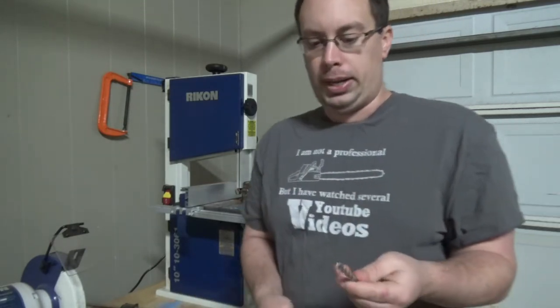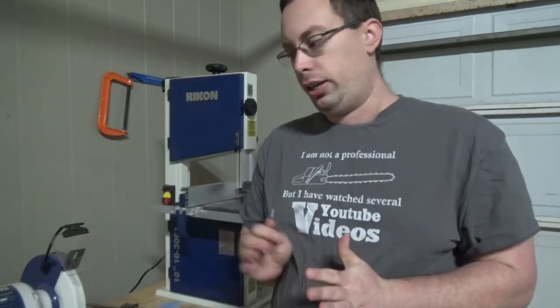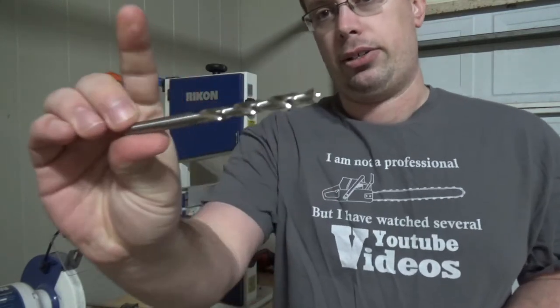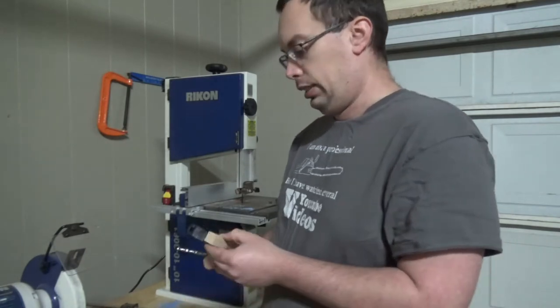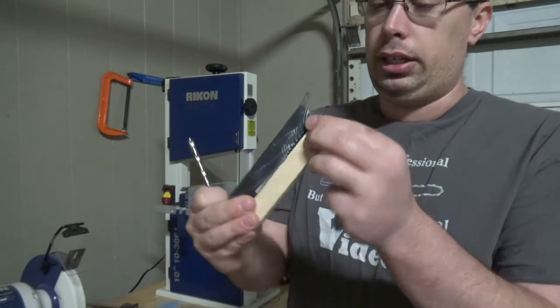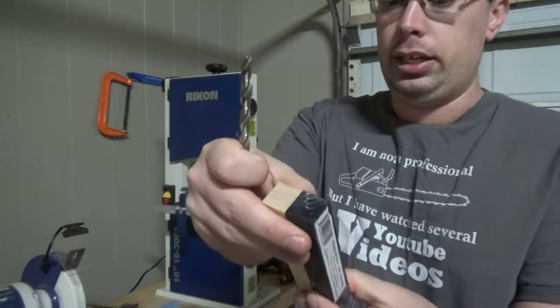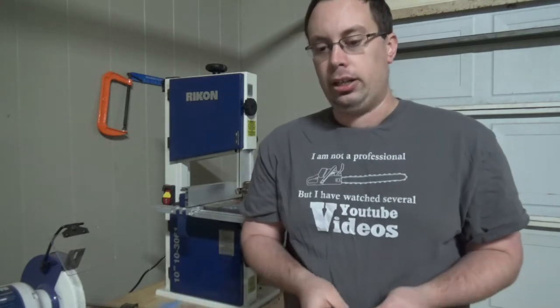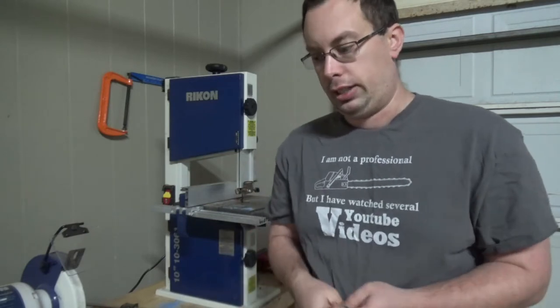You're also going to need drill bits. Now, your drill bits are going to depend on what kit you're working on. It can range anywhere from 7 millimeters all the way up to 15/32nds, and you're going to be getting into some weird measurements. There's even ones that have a letter assigned to it instead of a fraction of an inch. But again, look up, see what your pen requires. In this case, it's a 7 millimeter, so it's not that big. And usually the smaller size ones are going to be okay for these 3/4 inch square blanks. If you're going to go anywhere close to like 3/8 of an inch, you're likely going to require a bigger blank to avoid causing it to fracture, because I've had that problem in the past.